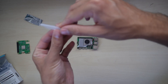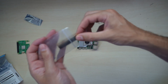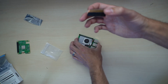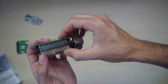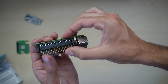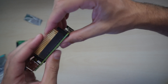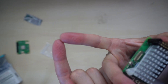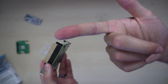Now we're going to take that GPIO pin adapter and install it. According to the official documentation, it doesn't matter which way you do it — as long as you line it up correctly there's no right or wrong way. Just making sure they're lined up and gently pressing them down evenly. I'm a bit nervous because I'm using a little bit of pressure here — and there we go, pressed it down into place. That did take a bit of pressure and it hurts your fingers, so just be aware.